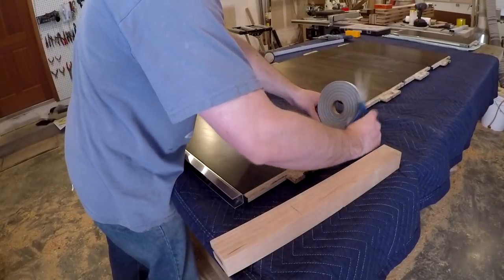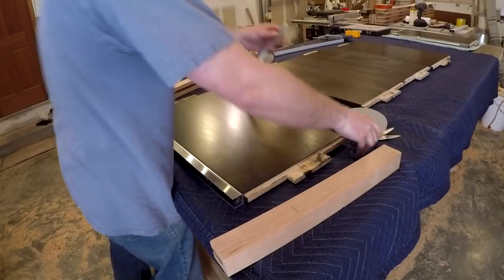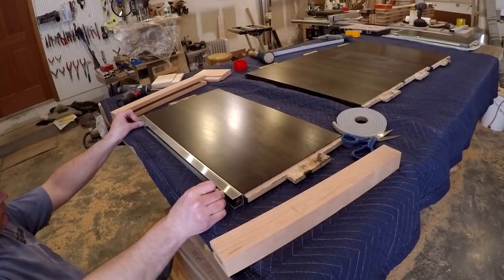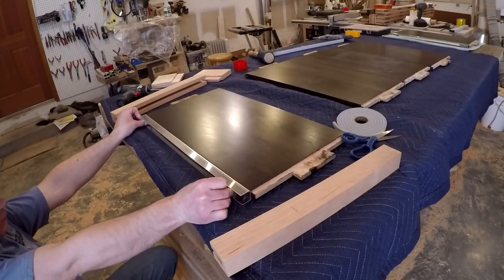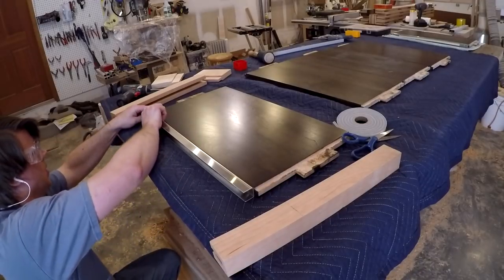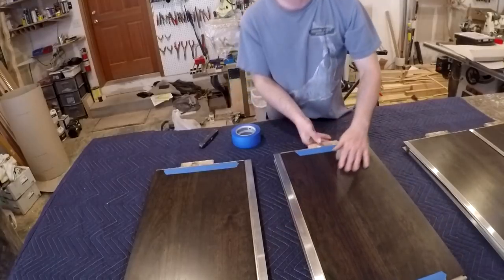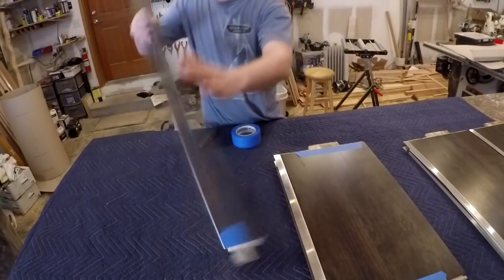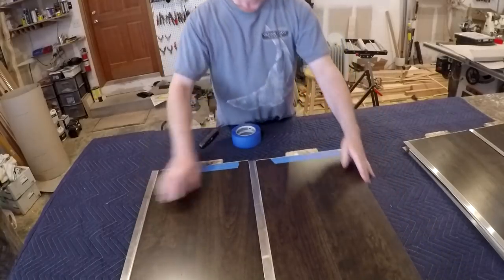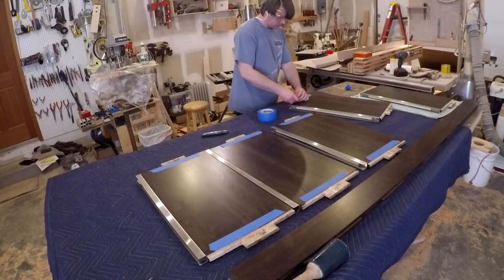For a little added insurance to make sure the panels didn't rattle — just in case the stainless steel came loose, or the panels shrank, or they just rattled when you shut the door — I put some weather stripping in there to take up the space so there would always be a little pressure against the panels to prevent rattling. Since these panels are pre-finished before assembly, I put a little blue tape around each tenon to prevent any glue squeeze-out. I'll remove that blue tape before the glue completely sets, just to make it easier.